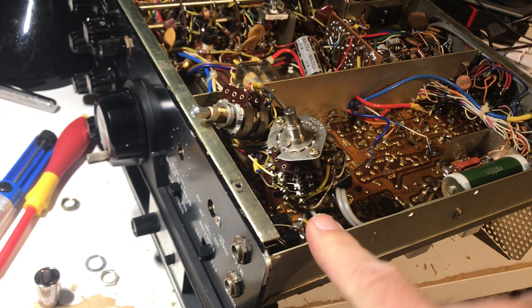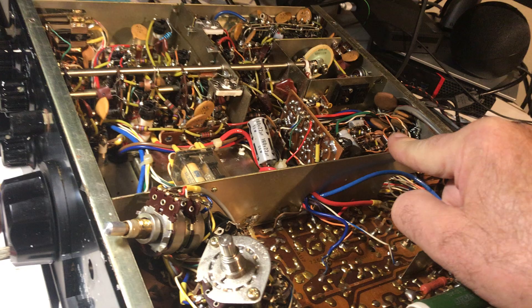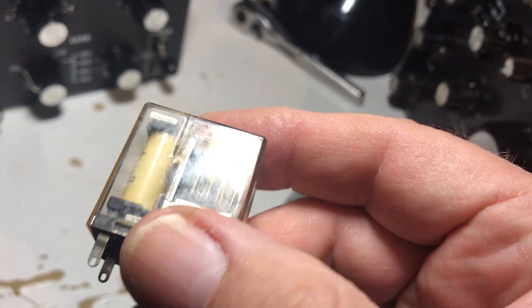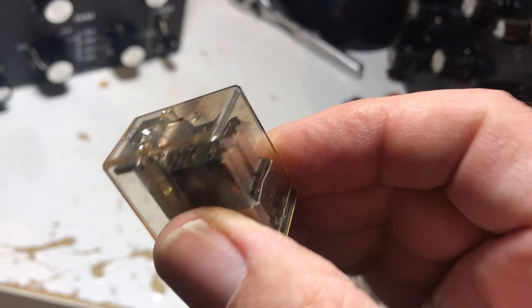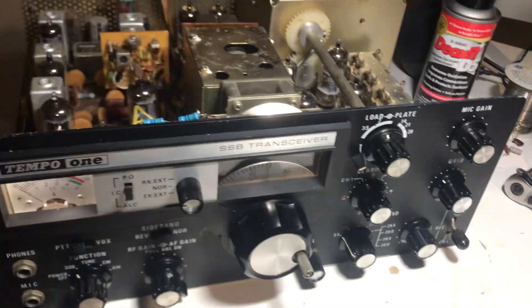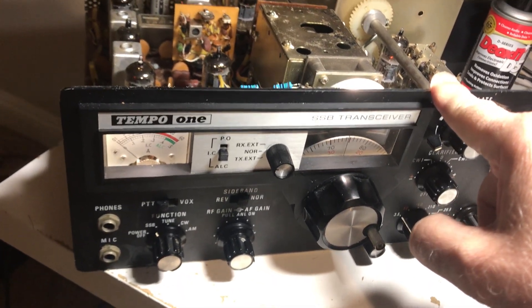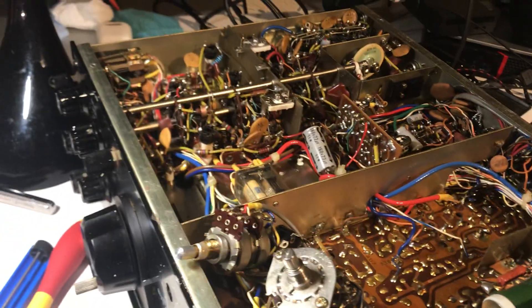Anyway, I fired this radio up and it did work. The 40-meter band is kind of wacky though. This radio was hit by lightning — the transmit-receive relay inside was blown apart. Here's the relay I took apart and tried to fix, but some of the contacts are melted. These relays, by the way, are selling for 90 bucks apiece from some greedy eBay sellers. So I took the relay out of the junker radio and put it in here, and it worked fine.